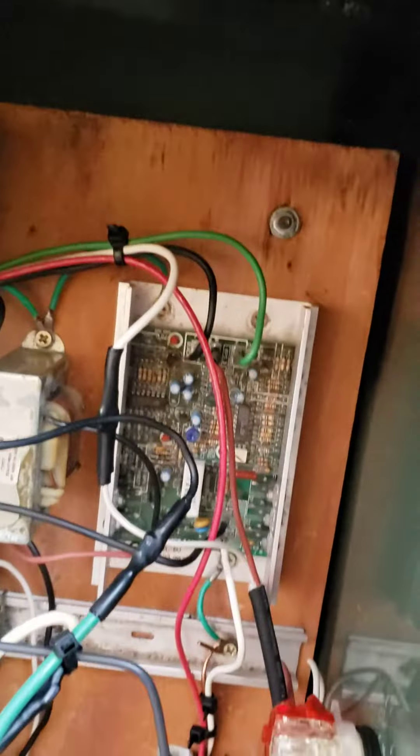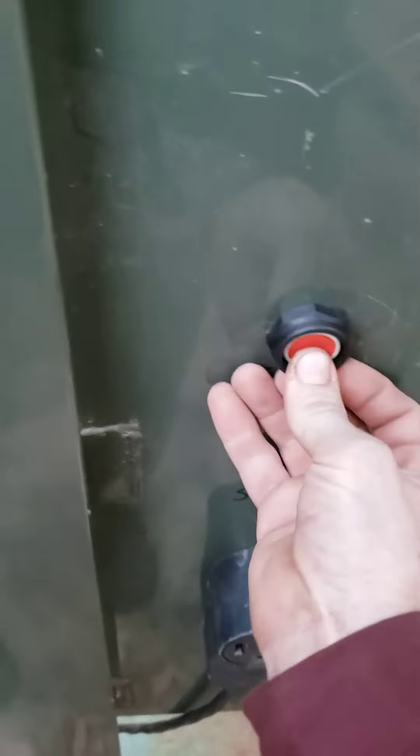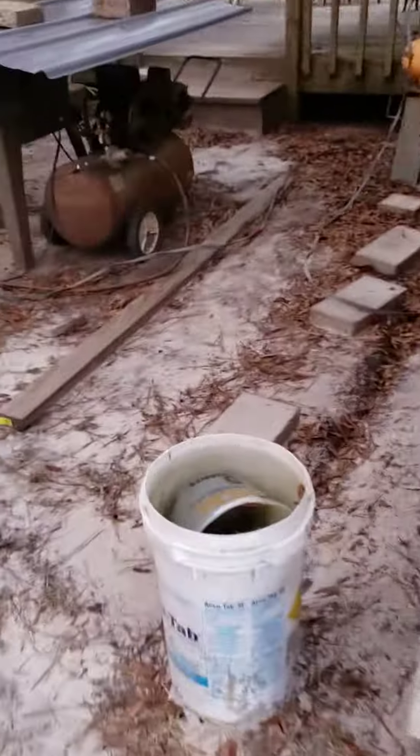When you kill power, it disconnects the first breaker, killing power to the whole system including the DC control. If you bump this really fast, I have power in and DC controls on. But DC has to reset in order for that motor to kick on. That's why you have to press. You hear how if I hold it in, the motor quits? That's because it has to reset power to the DC control as if the motor was just turned on, in order for that little motor to take off.